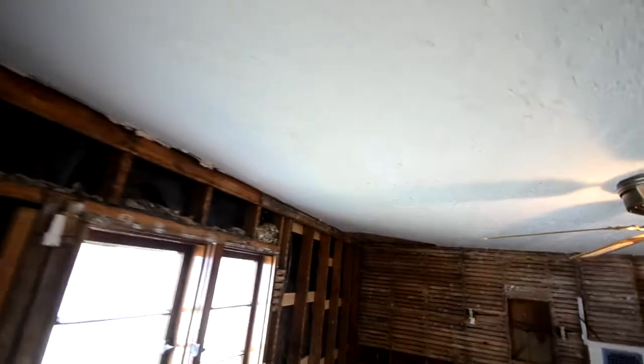Time to rerun all of our work. Now I didn't think about filming this before I pulled all the wire. But you see that hole coming around that corner? That was hard to make. And I'm in every single stud all the way across the top here. Just had that wire run and stapled. You can still see some of them left. Then down through the bottom. Stapled back up. Through that hole. Around that corner, another hard one. Staple. And then into the basement.